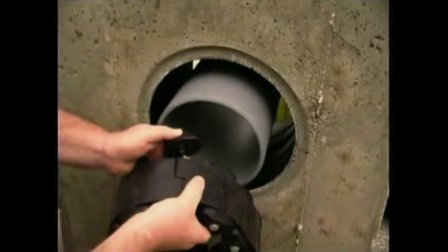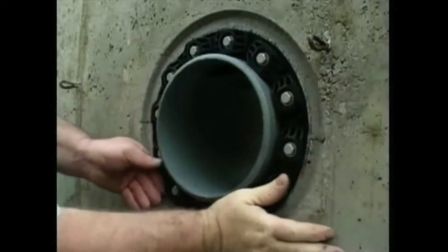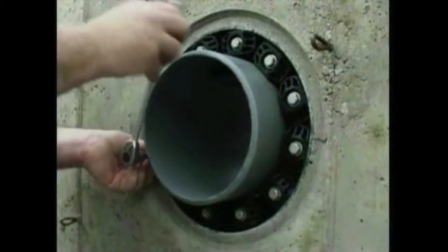The first and last links are connected and the belt is wrapped around the pipe. Sometimes the installer may notice extra slack in the belt — it may appear as though there are too many links for the installation. Tightening or preloading the belt will eventually remove this slack to allow easy belt insertion. The belt is positioned in the annular space between the pipe and wall. Some angular misalignment and eccentricity may be allowed. Pipes that are slightly off-center or installations where some axial misalignment exists between pipe and wall are sealed even though they are not perfectly centered. The installer begins the tightening sequence at 12 o'clock and proceeds clockwise around the seal, tightening each bolt two or three turns at each pass.